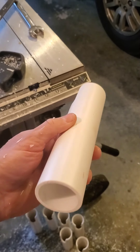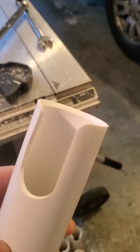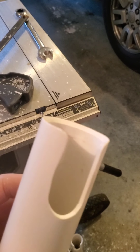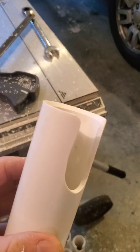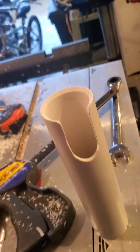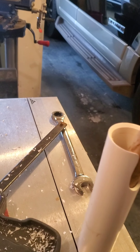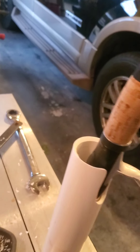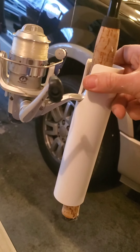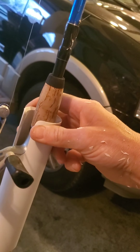We've got just a piece of PVC — this is inch and a half PVC. We've chamfered that inside edge with the router. That was pretty simple, just a trim router and a chamfer bit with a bearing running around the inside. And then we cut out this slot, and that's for the rod to go right into. These work best for spinning rods, but they also work for baitcasters. So it's just going to sit in there like that, and with that slot for the reel, it won't be swaying around too much.